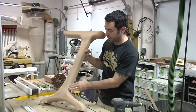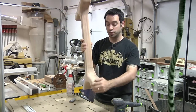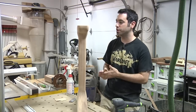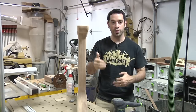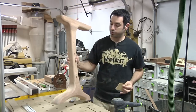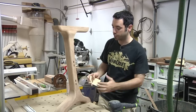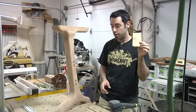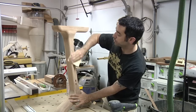This leg here has pretty much got all the sanding it's going to get at this point, and you can really see what I'm going for — just absolute smooth transitions. All those roundovers: for most of our work, that's usually enough if we're looking for a good rounded-over look, just hit it with a little bit of sandpaper and you're done. This is a little bit different. We don't want to see any transition at all from the three-quarter or one-inch roundover to the flat surface. We want to make sure it's absolutely smooth and soft all the way through. I'll hit the flat surfaces with my random orbit sander, but on these tight curves, the random orbit sander can create a lot of divots, so resist the urge. You've got to do it the slow way — go by hand, fold over a sheet of 180-grit sandpaper and go through and hit all of those edges. Smooth it out.